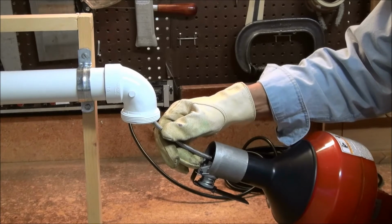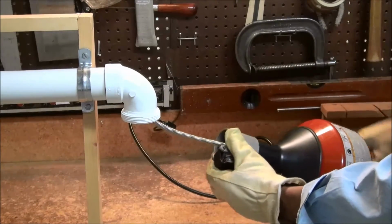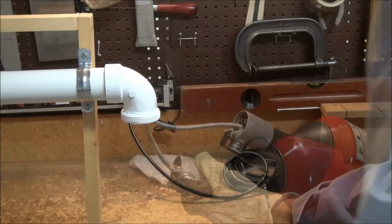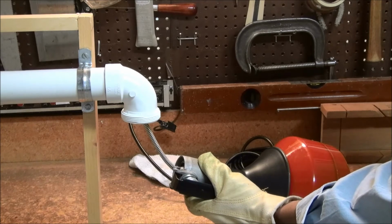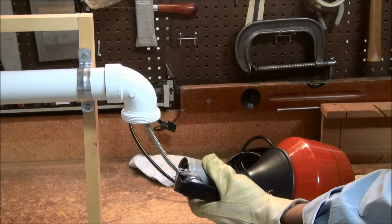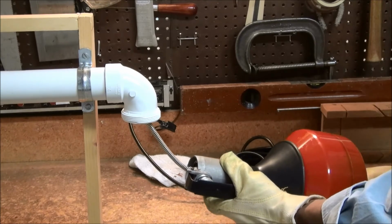That way you reduce wear on the motor. In any event, if you cannot retract the snake manually, that is, without the drum rotating, the drum should definitely not be rotating when the snake is eventually pulled from the pipe. When the snake retraction nears completion, stop the machine altogether and manually pull the remainder of the snake from the pipe.